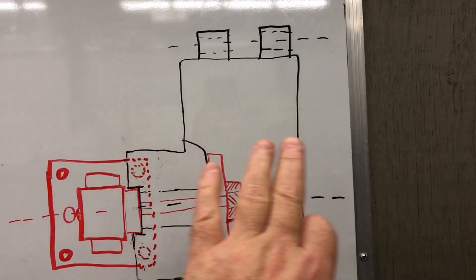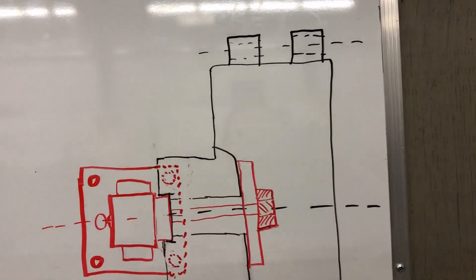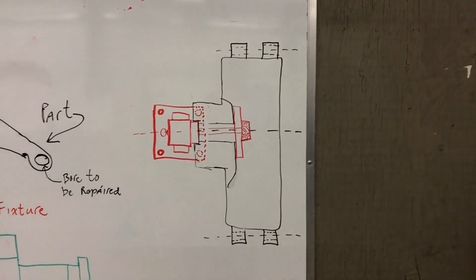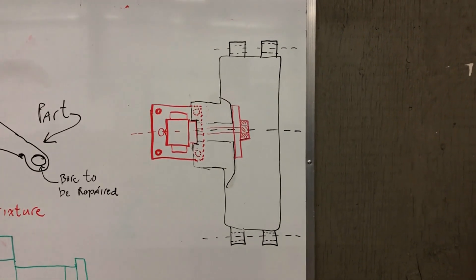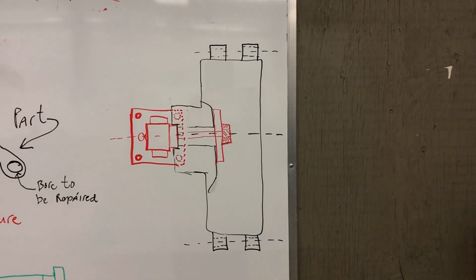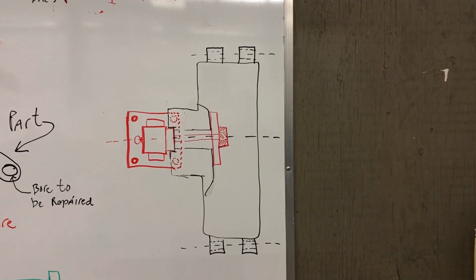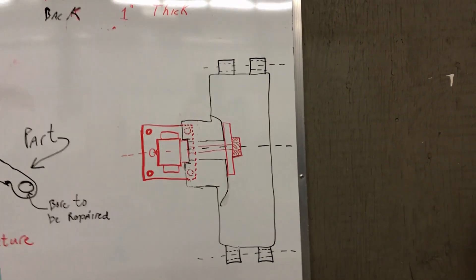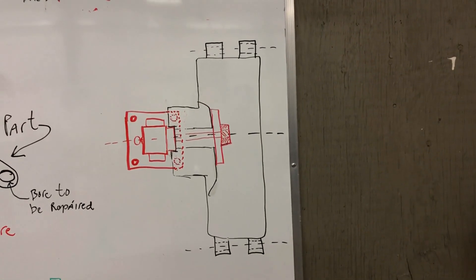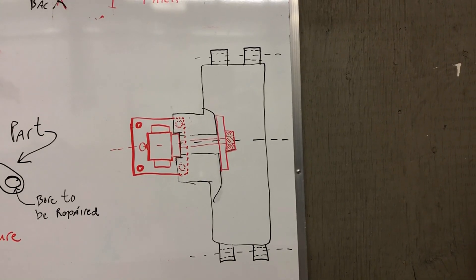The two parts were bored and then a pin was put through each end to hold them together. This part needed to be able to slide back and forth — there was a bit of clearance between the bosses so it could move, but they definitely didn't want it rattling around. So they needed a very close sliding fit on the pin, which meant the spacing between those sets of holes had to be very accurate. My task was to bore those holes accurately enough to press in a hardened bushing and get the spacing and parallelism close enough that the pin would go through without binding.